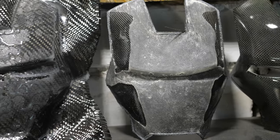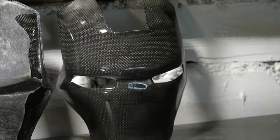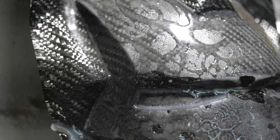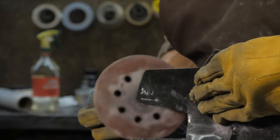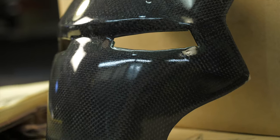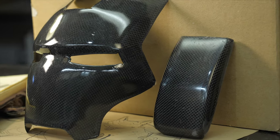Pay attention to the details in this review, because even though the finished part turned out nice, there are a selection of technological errors to learn from. The corners are too smooth because I couldn't get twill and used plain weave. Too-thick epoxy didn't fill all areas, leaving noticeable craters. The release wax apparently hadn't fully set, mixed with the first layer of epoxy, and made it impossible to apply a finish coat due to poor adhesion even after sanding. There was also grinding with too-coarse sandpaper, resin overheating, holes in the fiber, and polishing with the wrong composition — but in the end we still got a nice part. We show these mistakes so they don't happen to you. Now you know all the errors that can occur, and your very first part has every chance of being perfect.